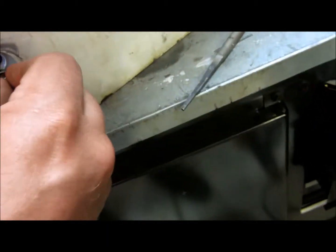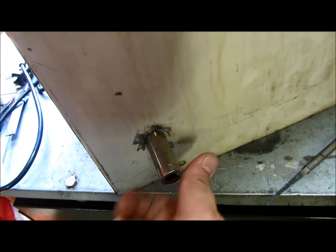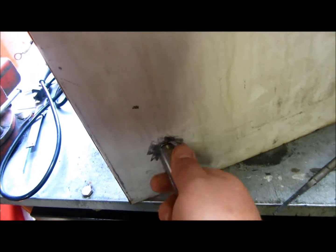Out of the motor end is the intake port. What I did was drill the hole but kind of boogered it up — I forgot to hold a piece of wood on the other side. I got up to a 5/8 bit, which is the biggest bit I have, so the rest I used a file. I filed the hole big enough to fit the socket I need to tighten that fitting.